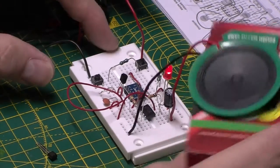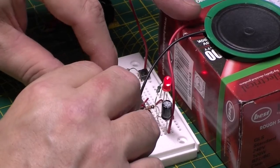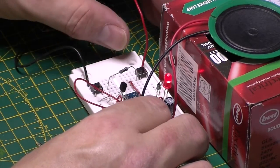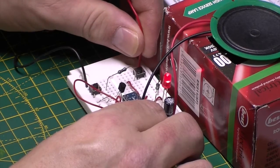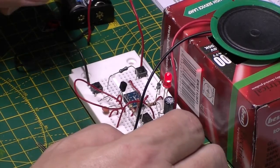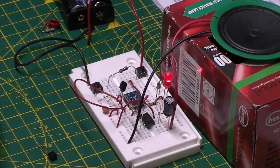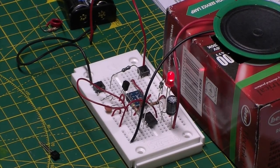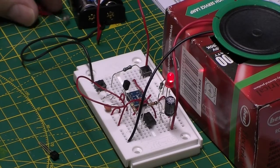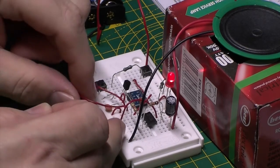One thing that I did notice, and one of my subscribers did point out, is that this loop antenna thing is rubbish. It might work better perhaps in built up areas, but here I'm out in the wilds a little bit and it ain't doing nothing for me. I can't pick up anything with it, so I'm going to be reverting back to the original wire, which at the moment is eluding me. Ah, there it is, down on the floor. So I'm going to pop back in that little coil that I wound, this one here. I'll pop that back in, and I'm going to get rid of this rubbish loop thing.